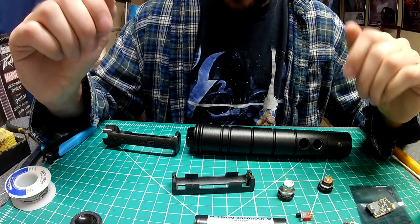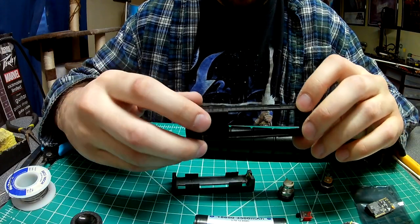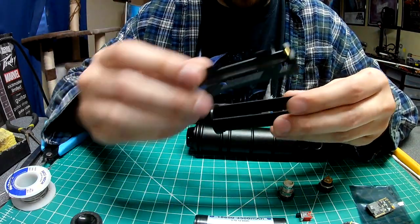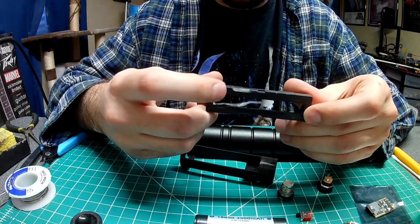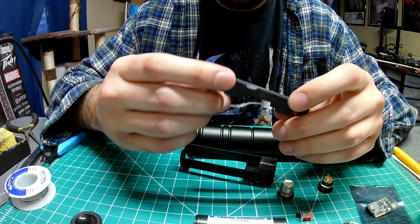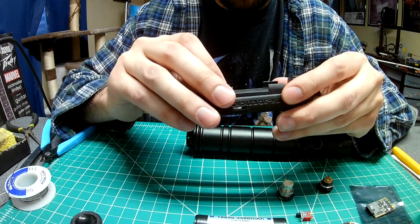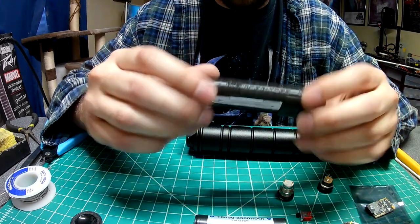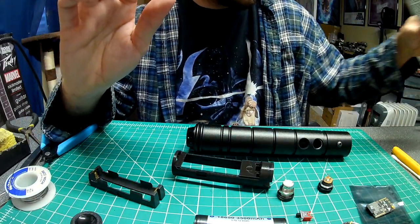Overview of the components: we have our KR Sabers Goth Redesigns PIY print-it-yourself chassis battery holder for a removable 18650 battery. When you get these battery holders, you'll have to sand down the little nubs and probably the corners too, and it'll fit right in. We'll also use a little E6000 to keep it secure. E6000 takes a little longer to cure, but I recommend it over anything else. I rarely ever use super glue — cannot recommend avoiding it enough.